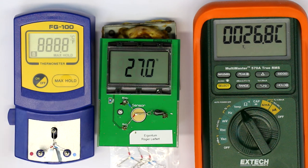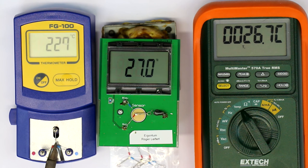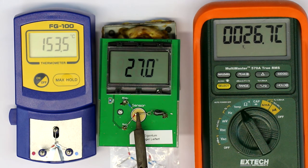And now let's make a final comparison if the ELV thing works again. And let's check all three one after another. I've set the solder station back again at 350 degrees Celsius. Let's see where we are getting here. You see it's again totally out of control. It looks like, or totally out of adjustment. It looks like depending on how you switch it on, it always comes with a different temperature. It should have stabilized at 350, but we are at 275.